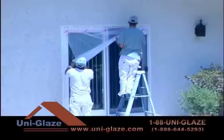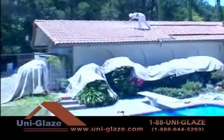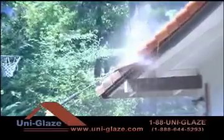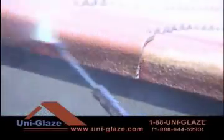The first part of the roof restoration process is to mask and tape the house. Special attention is given to covering plants and other important objects. Once this is complete, the roof is cleaned using a power washer which removes excess dirt, mold, and mildew. If the roof's tiles are excessively dirty, an organic TSP solution is recommended.